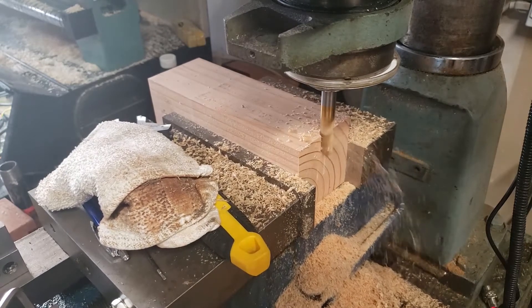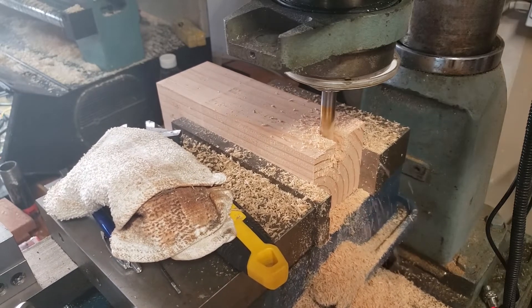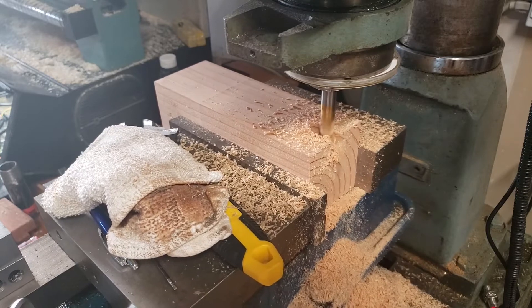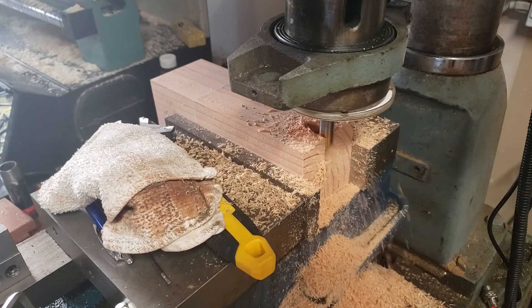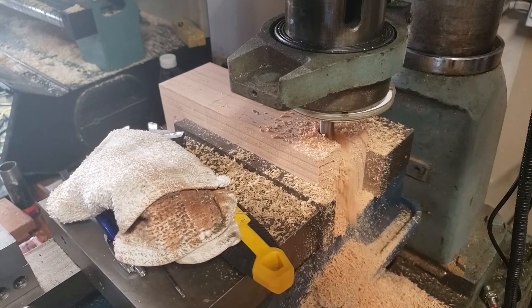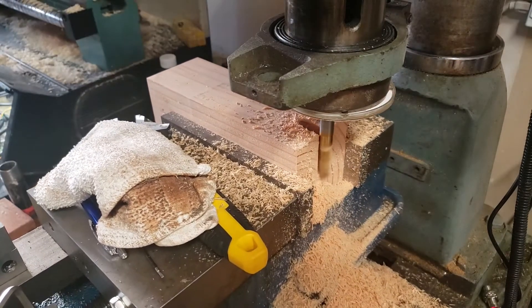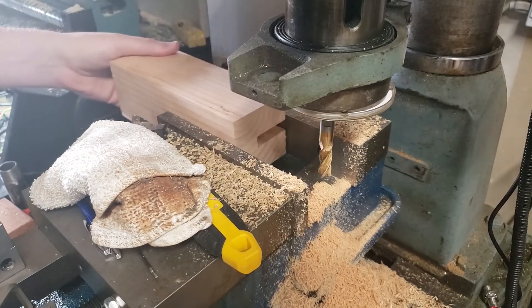Here it's going through and actually doing the first of several cuts. It's going to go back and do a second pass. If you look at what the plug-in looks like, it lets you define the depth per pass and all kinds of fun stuff like that. Here I'm just cutting pine so you can take a really heavy cut, but if this were going into metal you'd be talking about going thousandths at a time as opposed to going half an inch at a time.